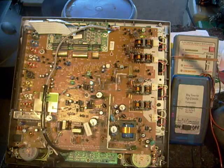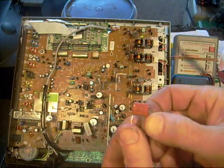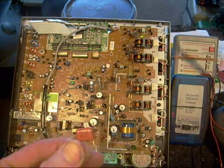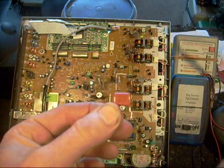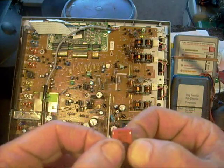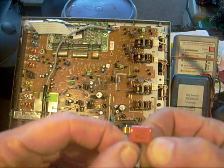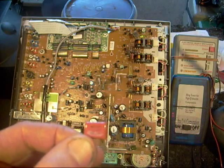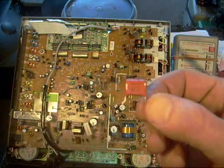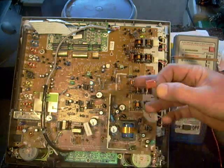What it turned out to be — thanks to Mike's TV case histories — I found a model almost identical to this one, and it mentioned a couple of polypropylene capacitors which I couldn't even test on my capacitor checker. They have unusual markings that are a little tricky to figure out. For example, this one says 154J, and that's actually a 0.15 microfarad capacitor, so it's got a very low value. One of them was bad, and it was causing half the screen not to light up.